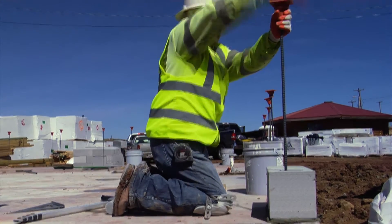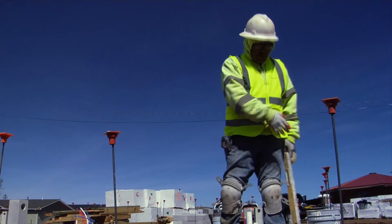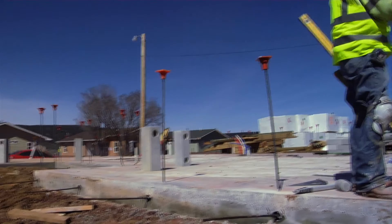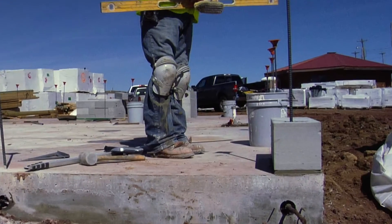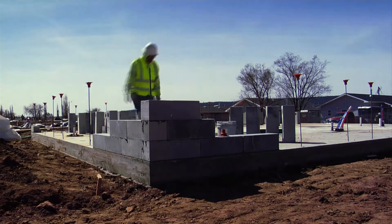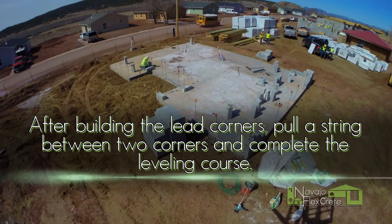Of course, you have to put your rebar cap back on. Just clean the edge. What I usually do is set all the corners like what I just did — set all the corners, then come back around and run my string line. Run the string line across and then go by the string line and my level, just using the bed mortar and the thinset. That's the only time we use the bed mortar is underneath.